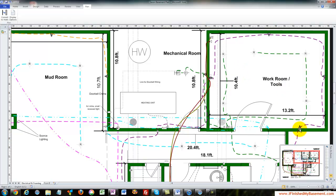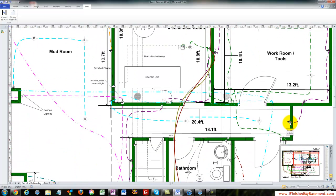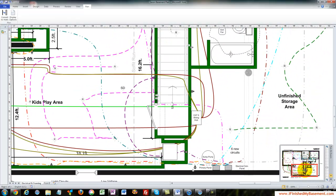The purple line represents the plugs. The circle with the two lines is an outlet, and the dotted purple line goes from plug to plug — that's the actual wire. In the drawing I show it crawling around the room so I can remember what circuit it's on. The circuits start back at the panel — this is the primary panel and the electrical sub-panel that I paid an electrician to install, which I highly recommend. I would not recommend attempting to install your own sub-panel unless you have some electrical experience.